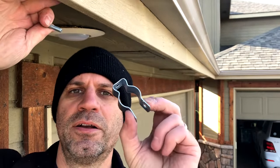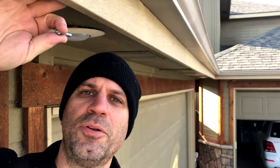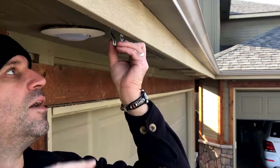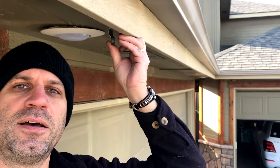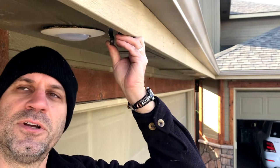After a good bit of trial and error, I landed on these clips that will hold the pipes in. Originally I had planned on putting them on the outside of the fascia like this, screwing a screw in there and holding the pipe that has the lights in it. But as I got started, I ran around one corner of my shop and all of a sudden I saw a downspout coming down from the gutters with no way to go around it. So I decided to move it up underneath the soffit. It turns out that actually works pretty well, because once the lights are in, I'll be able to swivel them after the season's over and possibly leave them up in the soffit for the whole year — just swivel the light bulbs up out of the way and they won't be very visible.